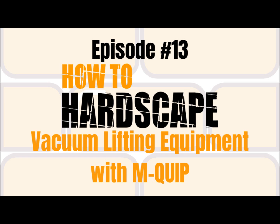If you're getting into larger two-by-two pavers and up, there are a few different vacuum lifters we carry. The Manelay and the Turbo Lem are very popular options — they both do very similar things. The Manelay has a max lifting capacity of 200 pounds and has a crane eye so you can use it from a machine if you have one on site. The Turbo Lem is a little more expensive and can handle 440 pounds, so it can handle a small four-foot concrete step. Both can be used in a two-man application and from the crane eye from machine. The Turbo Lem lifts a little more and gives you more versatility on the job site.